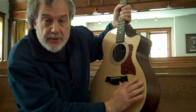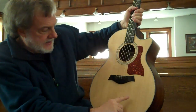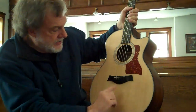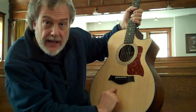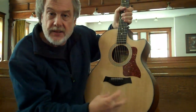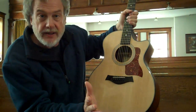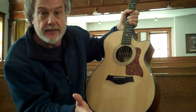The other thing that I look for besides grain consistency and straightness and evenness and closeness is what's called a medullary ray. When you take a piece of wood and cut it 90 degrees to the grain, a quarter sawn piece of wood, what you get, a phenomenon in most wood varieties, is these medullary lines that go 90 degrees. They're perpendicular to the grain, and they're kind of like waves. If you get one that's really dramatic, it's just an awesome top. This one had that. It had everything that I wanted in a 300 level top, because I've seen some that were pretty gnarly, you know, just not good wood.